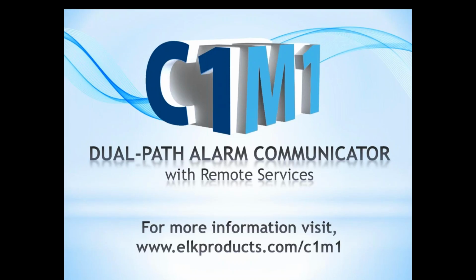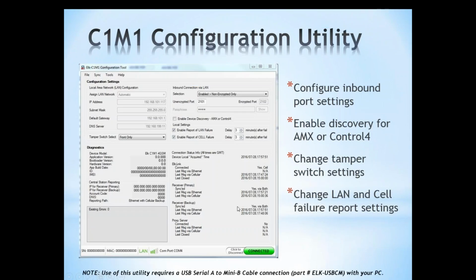And again, just talking about the security on that, maybe if we could hop back to this C1M1 utility page. You can see in this drop down you would have an option for enabling this encrypted port, which by default is 2102. Of course, you can change that port number, and then you're setting up a passphrase there, and that's going to allow you to have an encryption key, basically, that you're going to then need to put into your ElkRP software before it would allow a connection to that port directly, again, versus the proxy connection, which eliminates all that extra setup. But they did put the provision there for you.